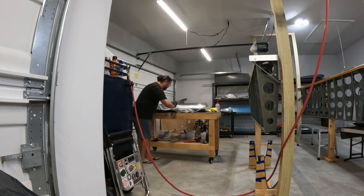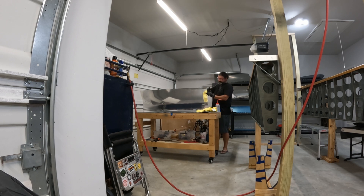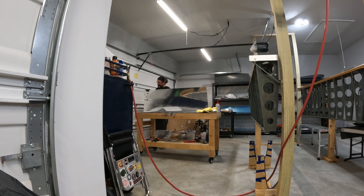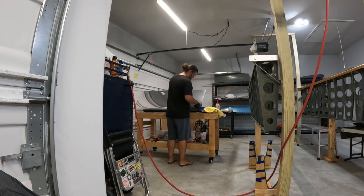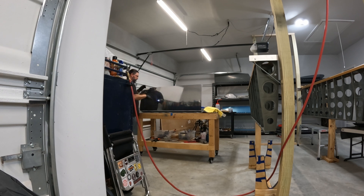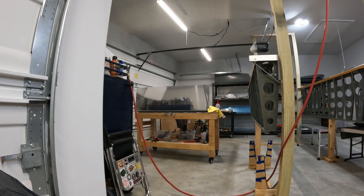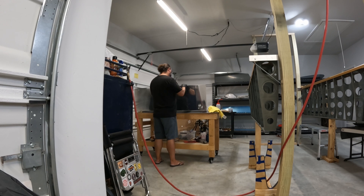This is pretty straightforward. The plan for today is to get the same work done on all the leading edge ribs. I think these leading edge ribs are clean — not like the tank ribs that had all that weird discoloration from the forming process. These leading edge ribs are not hydroformed; they're very clean, not all scuffed and scratched up. So I'm probably only going to prime the mating surfaces, similar to what I'm doing with the skin.